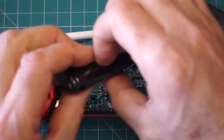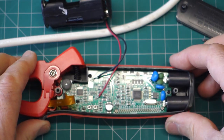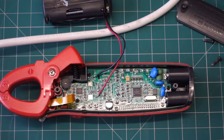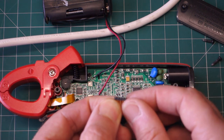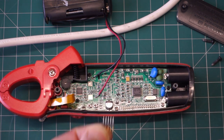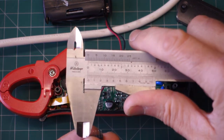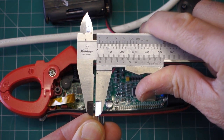So now onto the second one. I'm just going to pop one of these out whilst I'm working on the panel. Whoa, there it goes. So now I need to connect into these pins here. Now, awkwardly, they're not your sort of bog standard 0.1 inch. They are slightly different. I do have some of the different pitch ones. Let me just get a measuring stick on that. So, see if we can focus in on this a little bit. Roughly, what's this?